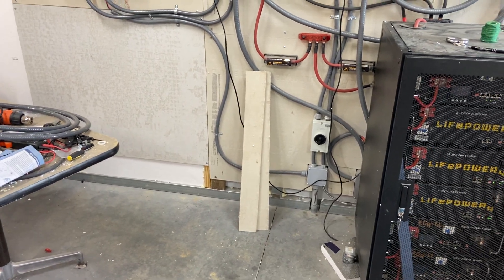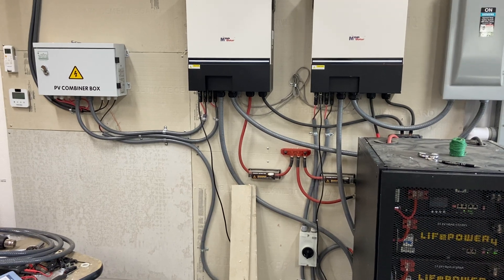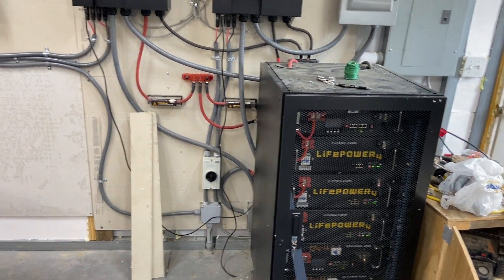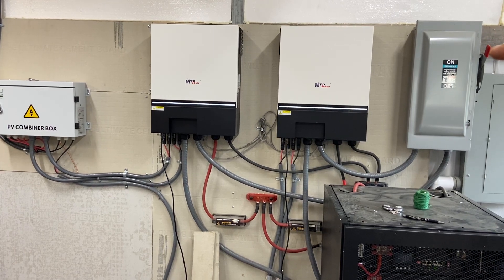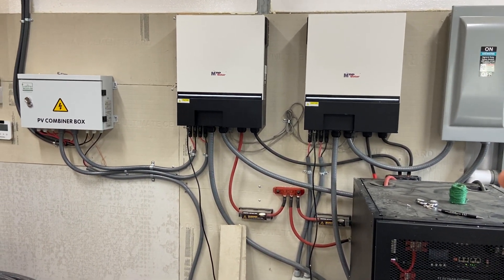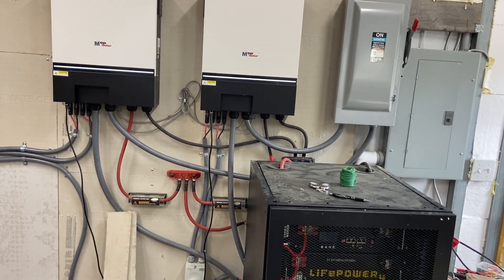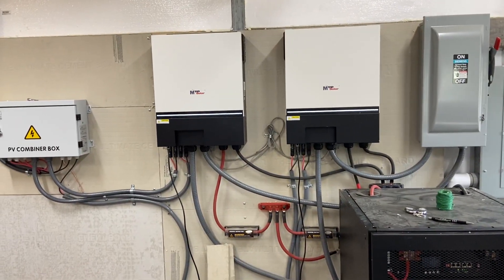You can push that up — 30 amps or whatever — but it's still going to take some time. The larger the bank, the more time it will take. These units come preset to 60 amps per unit, but they can output 120 amps of charging current at 48 volts — not at 120 or 240 volts, but at 48 volts. So if you set this unit to 120 amps, that's around 5,760 watts of panels you would need just to charge at its maximum.